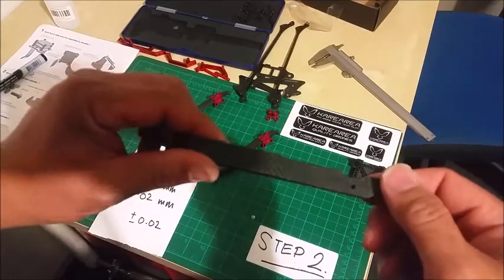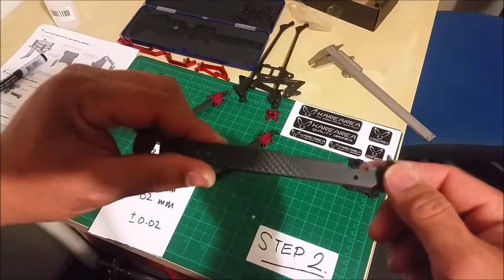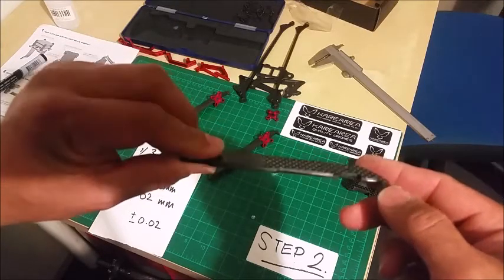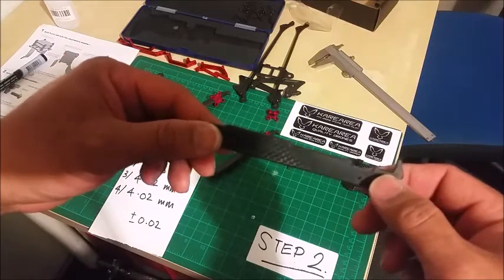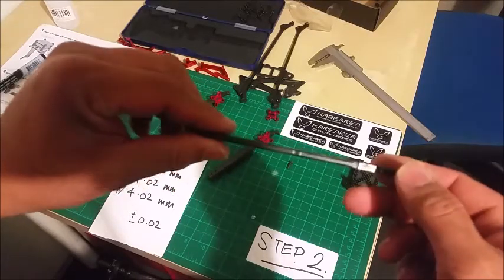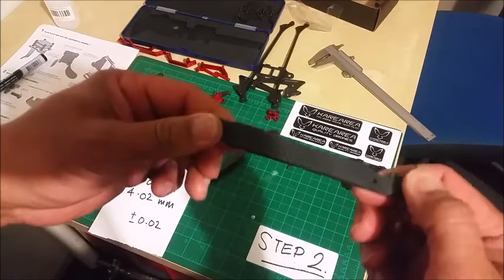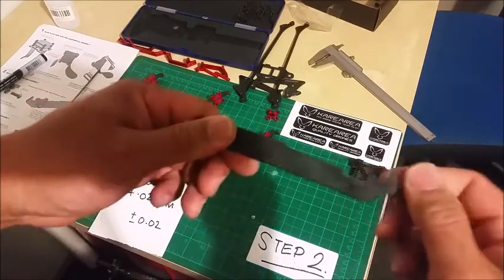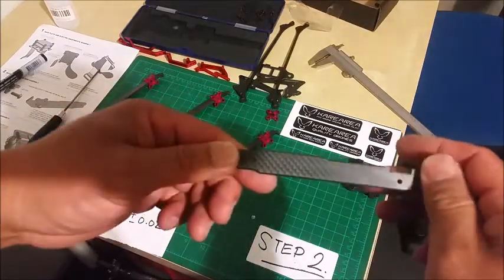Because I'm not actually too concerned about the strength aspect, because if it has been laid unidirectionally, a little bit of matting on the surface is not going to make a big difference. There's plenty to make 4 mil. That's quite a lot of layers of matting, so I'm not really too worried. Anyway, so I've put a bit of finishing resin on it.